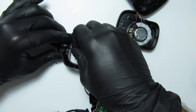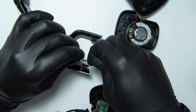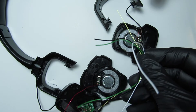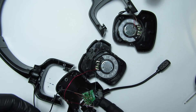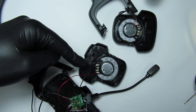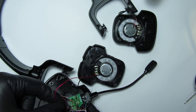I am under the impression that voltage is not being delivered to the earpiece, so let's run a little modification to this headset. For this mod, I'm going to use one of the five jumper cables from an old iPhone 4. We will create a direct lead by connecting the voltage pin from the left earpiece and merging the other end to where the voltage lead of the right earpiece lies on the PCB.